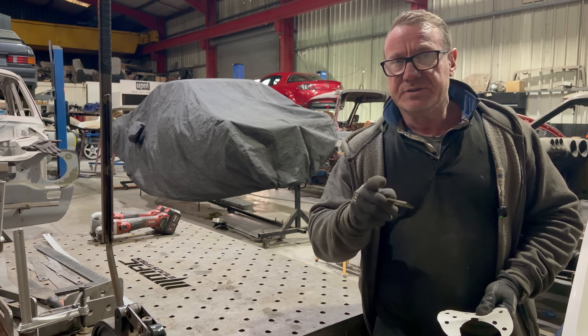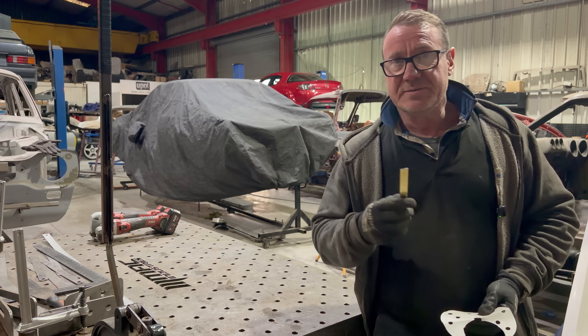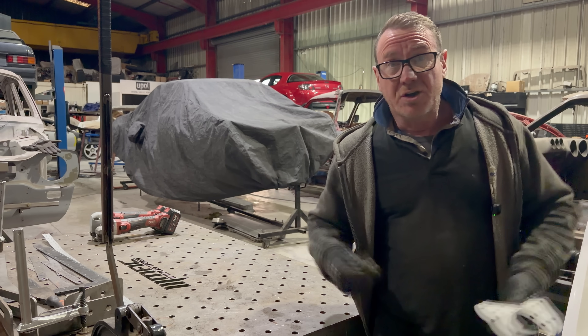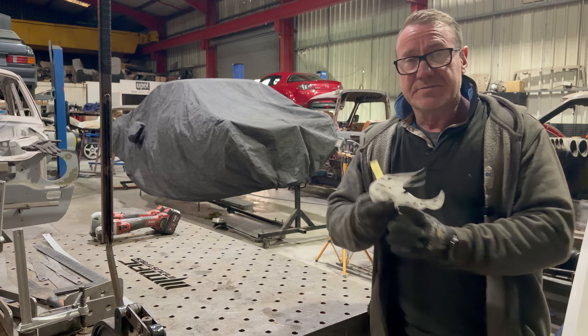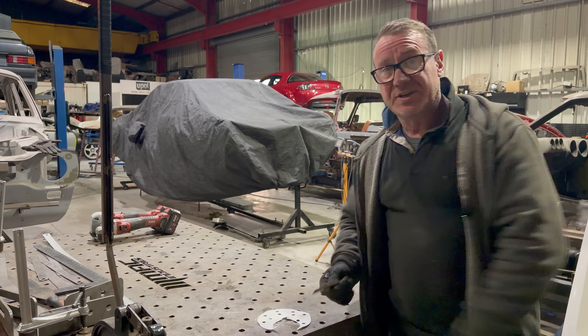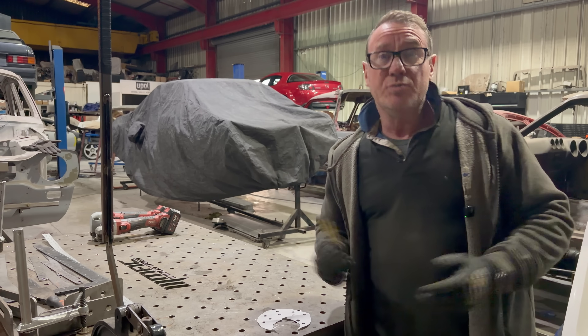Apparently with nitrogen it's a lot cleaner with virtually nothing at all and your edges are a little bit cleaner, but we're just using compressed air — it's cheaper. All we're going to do is lay some 180-grit flat on a bench and just scuff up and rub those edges to make it all nice and smooth. That'll take about two minutes.